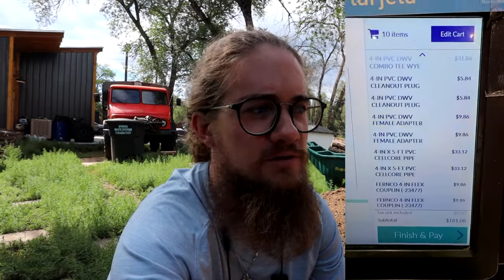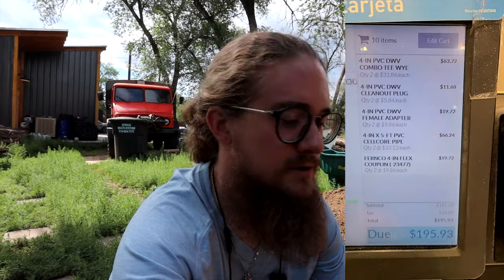So now that you've found your sewer and you've dug it up and you want to install these cleanouts, what do you do? So you need a little bit of space. You need to expose probably about 4 feet of pipe to install the cleanouts, have enough room to work down there. And really just a couple $100 in parts. I think I got footage of me at Lowe's buying this stuff. No special deals, no nothing like that. I think it was like $180. And so, other than the blood, sweat, and tears you put into it, it's fairly cheap to install cleanouts.